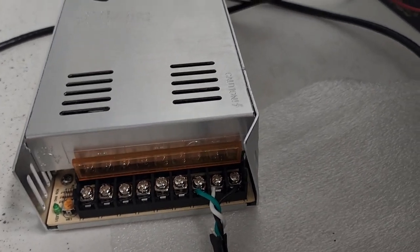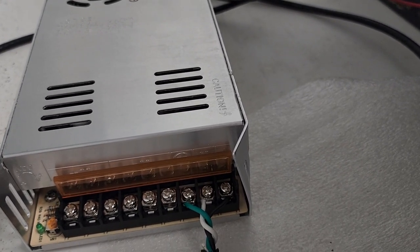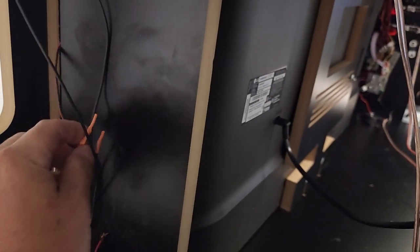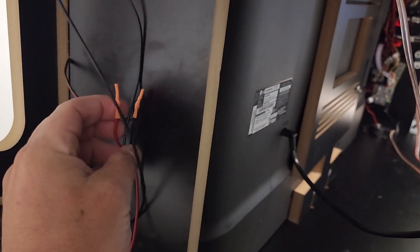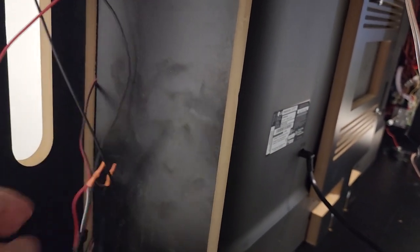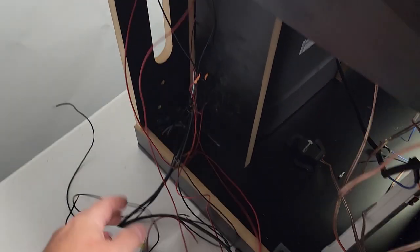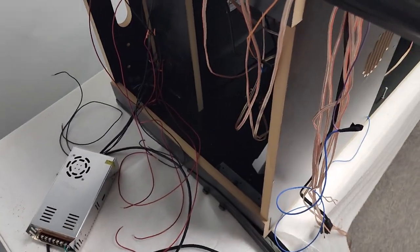I have my data. I'm going to splice the cable going from the playfield left to the playfield right, and run all the power. I'm going to go ahead and double-side tape the power supply right there so it's out of the way where all my cables are. I've already ran all these — there wasn't really any soldering, more just electrical tape with a little heat shrink. Don't get overwhelmed — essentially all these cables are just the power positive and negative to the three matrix and the two playfields. I'm going to wire all that up now.